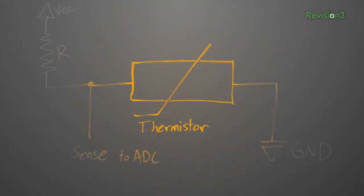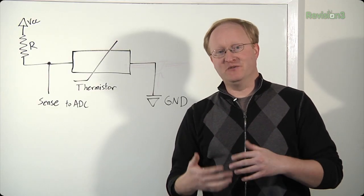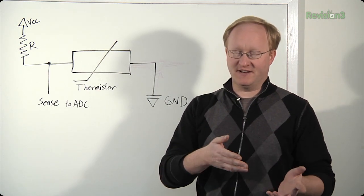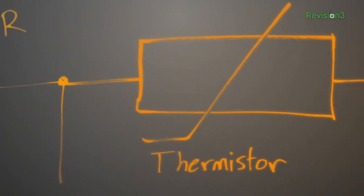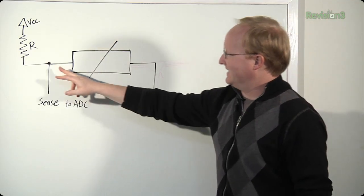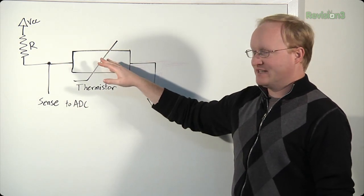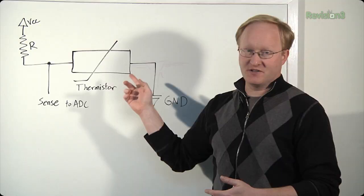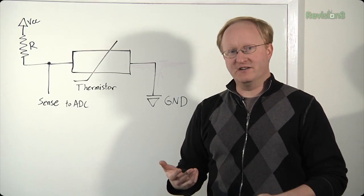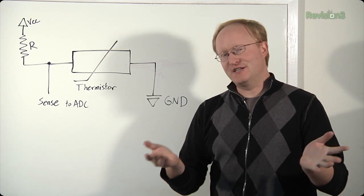Now it's time for a tech timeout. Let's take a break to talk about thermistors. A thermistor is a resistor that changes its resistance based on temperature. We're using one in our hot glue gun to tell us when the tip is hot enough to extrude glue, so we don't try to run the motor before it's hot enough. Basically, you hook up to your positive voltage, go through a resistor value to divide it — it depends on the thermistor value, usually 10k or 100k — and at this point you go to your ADC so it can sense the analog voltage. The other end goes to ground, so depending on the temperature, this voltage will go higher or lower. Then you find a table online based on the thermistor value and that'll tell you what the ADC reading equals in degrees. It's a calculation that's usually already been figured out for you, so just find it online and use it.